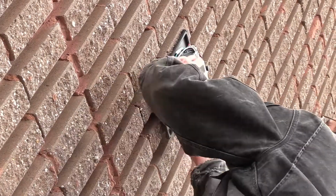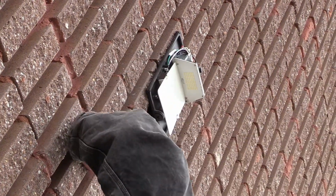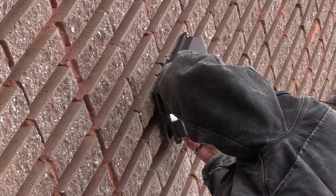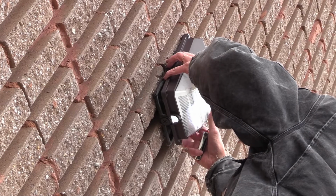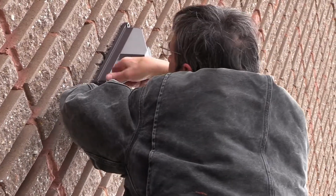After wiring, reinstall the reflector sheet by squeezing the toolless tabs on each side. Finish up by securing the diffuser firmly to the back plate and using screws to hold it in place. You can make sure the top and bottom are oriented correctly by referring to the markings on the diffuser.